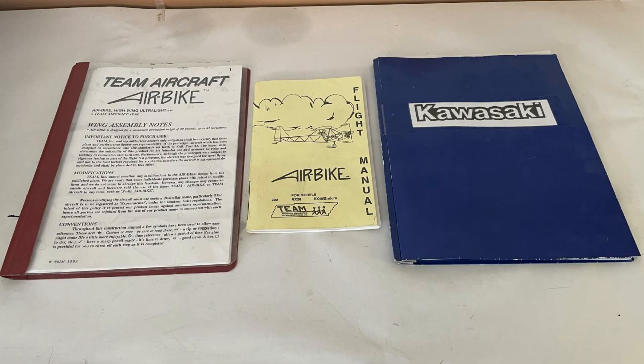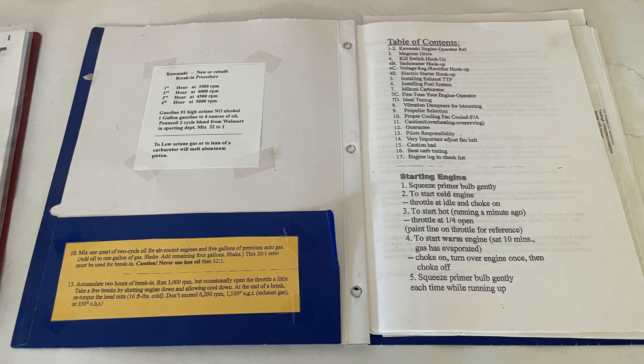My Kawasaki engine — I got it from a place called Jaybird up in Wisconsin, a really super nice guy with great support. My engine started literally the first time I turned it over after priming it. One thing to consider is the moment arm on the motor mount — the length of it is how you're going to get your center of gravity right. My motor is pretty heavy and I estimated how long my moment arm should be by measuring some different weights of what things were going to weigh on the aircraft. When you go to select your engine, in England they call everything a motor, but here in the States an engine is internal combustion and a motor is electric. There is a guy I know making an electric one — he's planning on getting a 20-minute flight, and I think that's pretty cool.